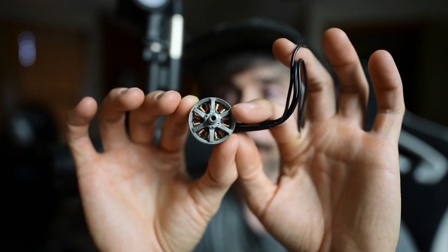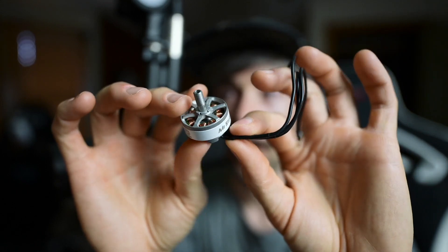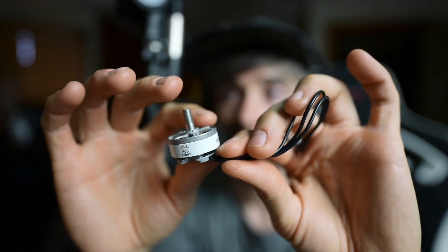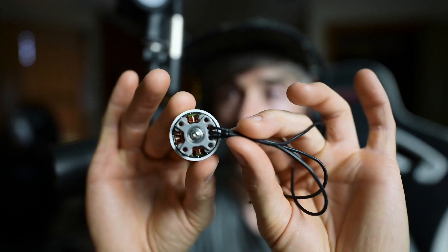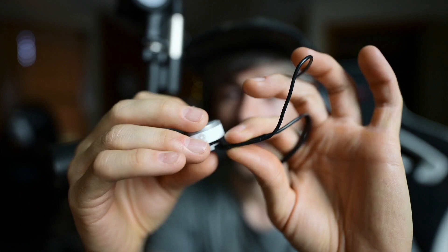The difference between the Legacy motor and the standard V3 is the winding thickness went from 0.4mm to 0.43mm. We also did a raw tumbled aluminum finish on the base and top, which shaves about 0.3 grams on this motor — which was already very light. So you're pushing roughly 27.5 grams with the Legacy. Let's look at some pictures to show the exact weight differences between all these motors.